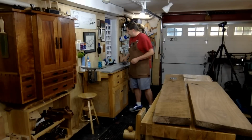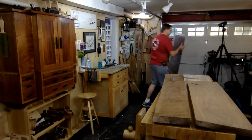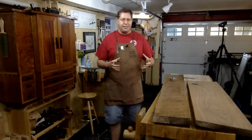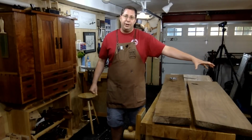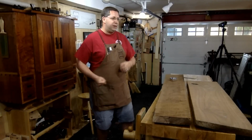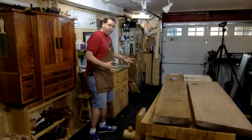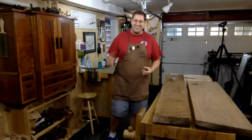It's going to be built entirely out of plywood, because I have some plywood left over. If you guys remember the Woodworkers Fighting Cancer build a couple of years ago, I think, where Mark made a kid's table and chairs, I did the whole thing out of cherry plywood. I have some leftover cherry plywood, about just enough to make a carcass. And I'll probably make the vertical dividers out of solid cherry, because I've got some thin stuff floating around. Couple of cross stretchers, so the whole lower case will be its own box. I may even pocket screw it together. Just want to get this thing done.